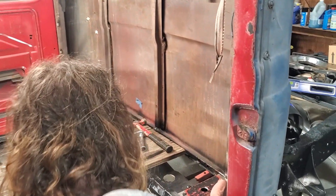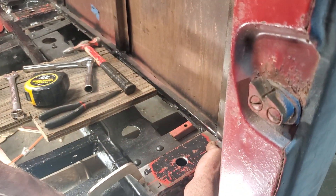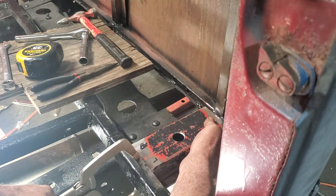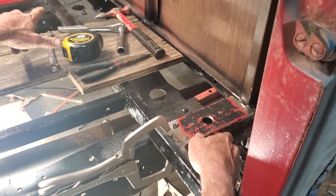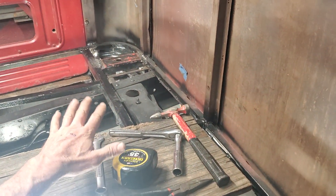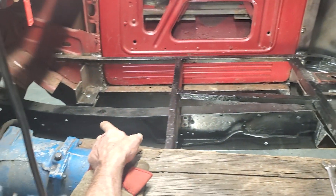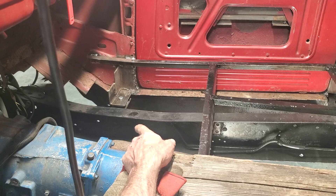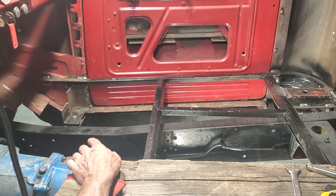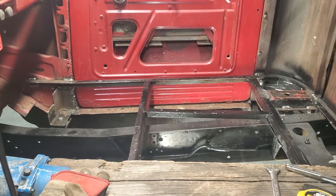It slides up in there like this. I'll clamp it here. I've already done the other side — I started in that corner over there, got that one where it needed to be, and got the ground height correct on that. Then I went to this one up here; it's got two of the angle braces on it. Got it the same height, clamped it together, drilled the holes, then tacked it, took the bushing out and welded it up. Same thing we're going to do here.